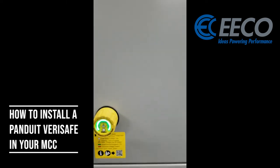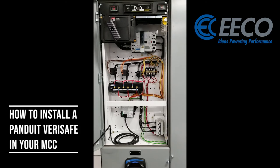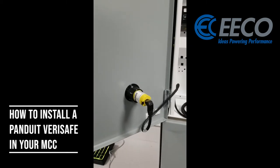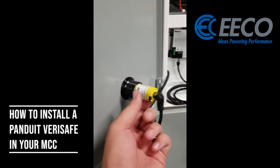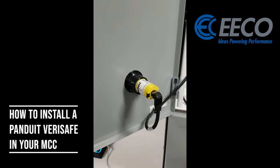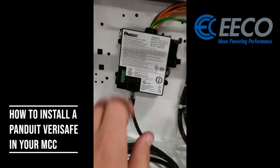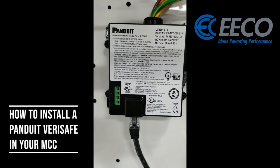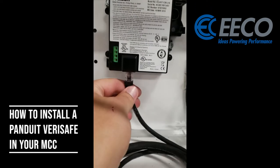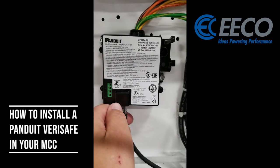Now I can go ahead and open up my bucket. We've got the main breaker open and you can see inside all the different devices for this main breaker with the Eaton MCC. On the back of the door is that VeriSafe unit we were using. There is an AA battery that goes inside of it. It just mounts on your door using a 30-millimeter knockout, and it's got a cable that runs to the base unit. There's the base unit — you'll see it has some contacts on it. The cable plugs in right here. This unit can be DIN-rail mounted or you can use screws and mount it to the back plane.